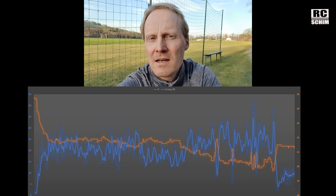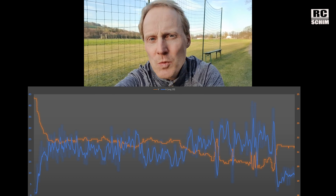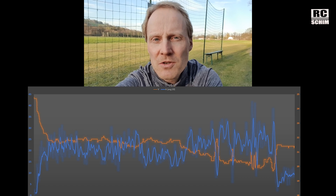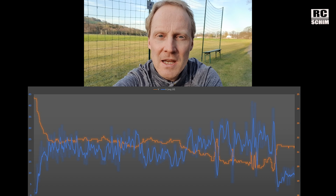I wouldn't fly like this on a normal cruise mission — that was around 50% more speed than I would normally cruise at. While flying, the amp draw was 20-plus, with 30 amps on rare occasions, but most of the time around 20 amps. On a normal flight I would average 15 amps, and then the pack stays below that temperature, of course.